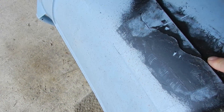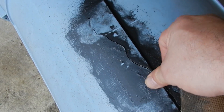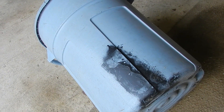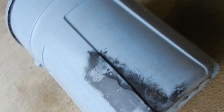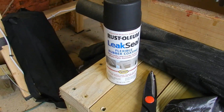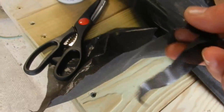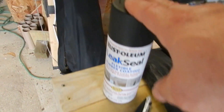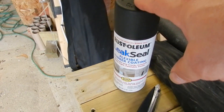The surface is about as clean as it can be. I'm not worried about getting the crack closed together — it'll close with the seal that goes on it. But look inside for any light and plug those up. What you're going to need is a spray: Rust-Oleum makes a great leak seal flexible rubber coating. I would go with the thin weed blocker fabric — I have a roll right here left over from a project. Wear gloves because this stuff gets on your hands and you'll need mineral spirits to get it off your fingers.